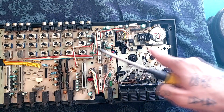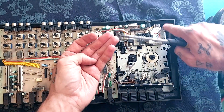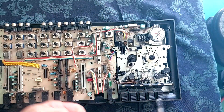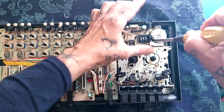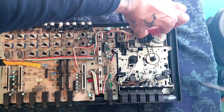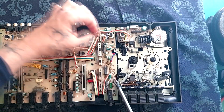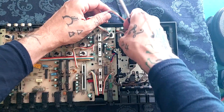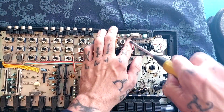I've looked at this kind of cassette player a couple of times so I'm familiar with where the screws are - this really reminds me of where they're located on an X15. That's kind of loose now. I just need to watch how this little daughter board up here is connected and figure out where these cables connect together. That looks like it's soldered at both ends - there's another screw here.